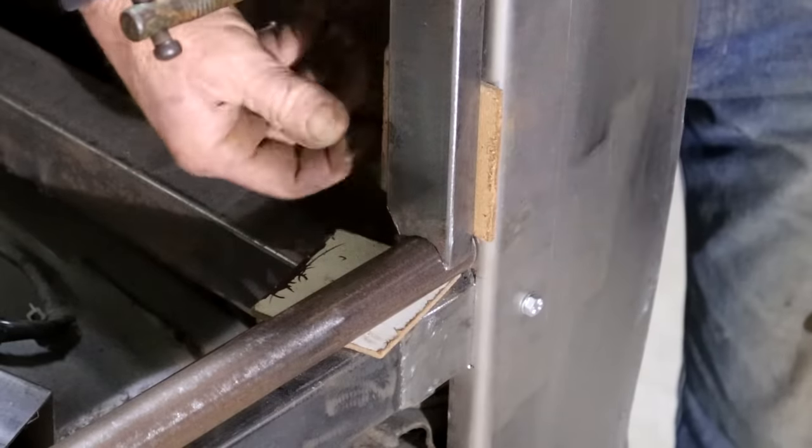To extend my piece of square tubing, I've got it clamped down onto my table which is a flat surface, and on this side I've got a piece of angle bar that serves as a straight edge — so now it's got to be straight. My extended piece is nicely welded on and I've capped my ends. So I think before I weld this thing together, I'm going to think one step ahead and figure out what I'm going to be doing for my hinges here — I need to figure that out first, drill the holes, and make it all up before I assemble this frame.